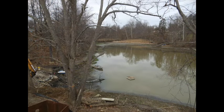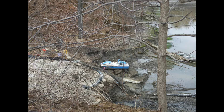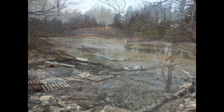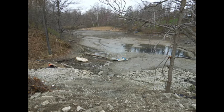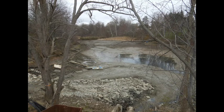Draining the Alouette Plume Lake was a multi-step process that began shortly after it was determined that the dam needed to be removed. The first step involves siphoning the water through the existing 27-inch culvert under Morley Road to the downstream side, followed by the installation of an 8-inch pump. The process to drain approximately 13 feet of water was completed over an 8-week period.